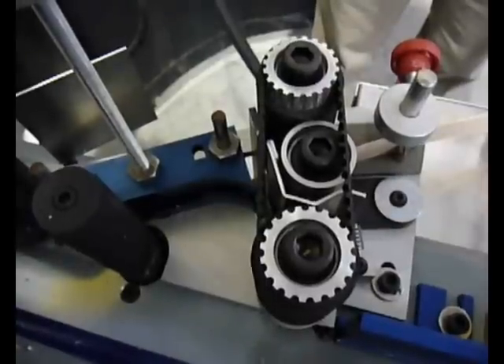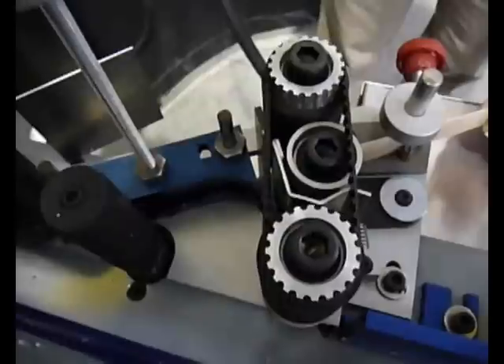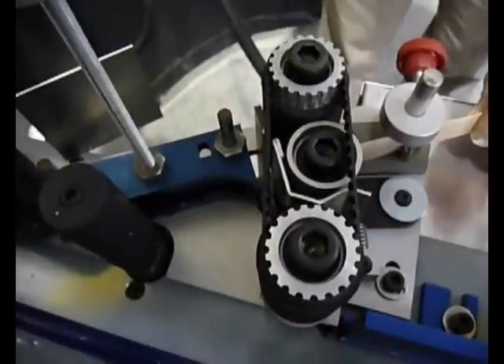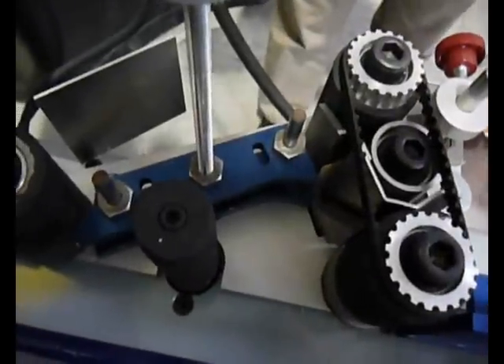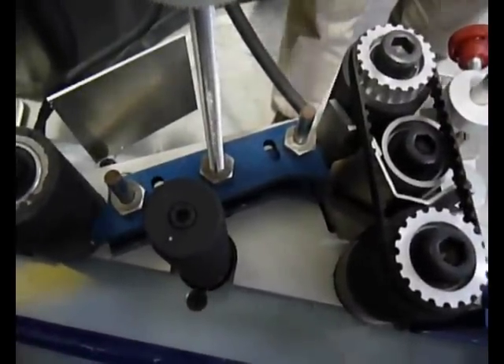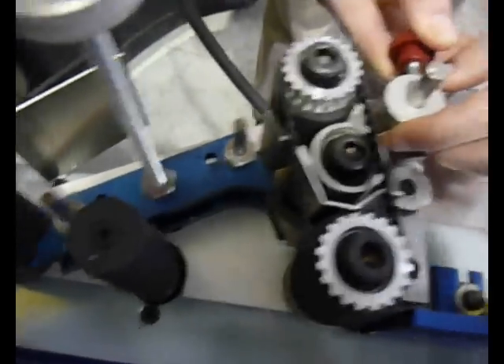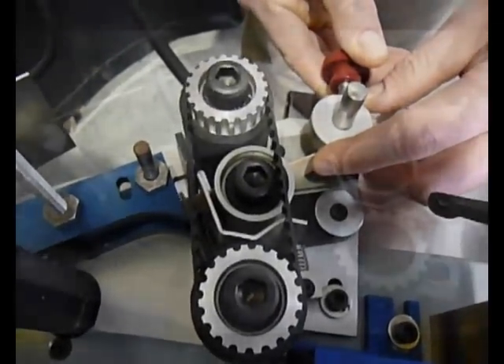Place the tape end between the rubber-driven roller and the metal pinch roller. Turn the rubber tape advance roller so the tape end just passes the in-feed on the carbide knife. Adjust the tape in the ring donut height with approximately 1/16-inch clearance, using the plastic knob to lock into place.